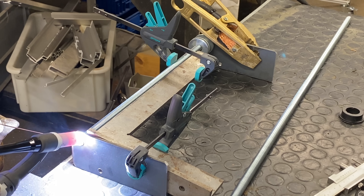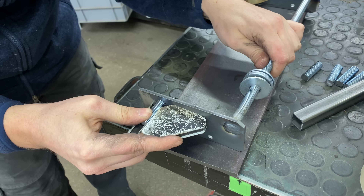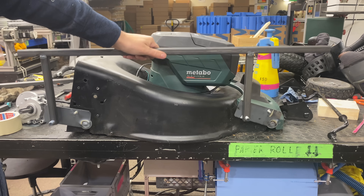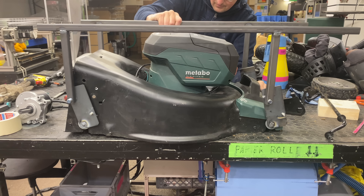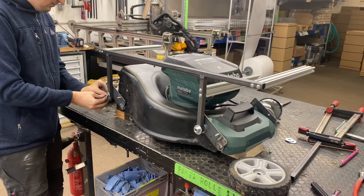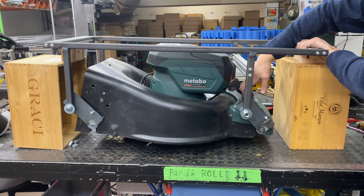I used some threaded rod for the bar because I have a nice stock of different threaded rod sizes so I always have the right diameter at hand, which isn't the case with steel rods. I bought a lot of steel tubing recently just to keep in stock in the workshop — it's always handy because I find working with steel much easier than working with aluminium extrusions. So this is the linkage and it works quite nicely. To connect the two sides together I'm using aluminium profiles — you can easily tap the ends and make 90-degree connections. I need to be able to take them apart again, otherwise I could never separate the linkage from the frame at the top.